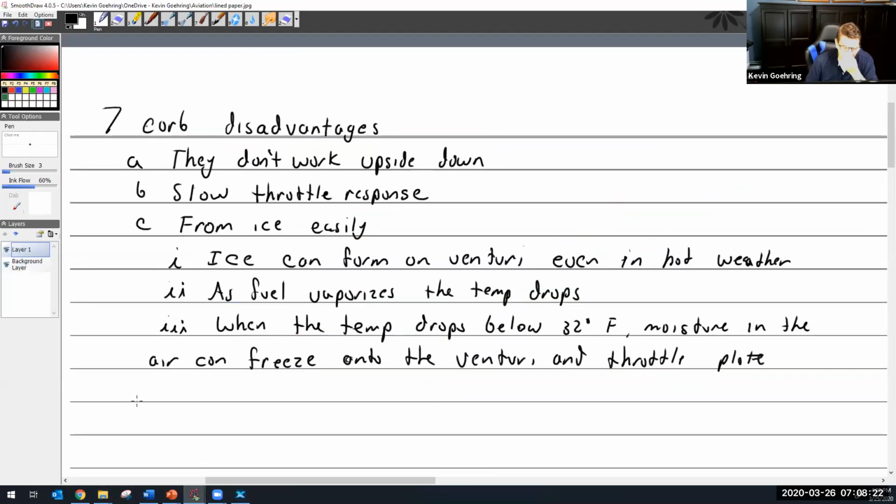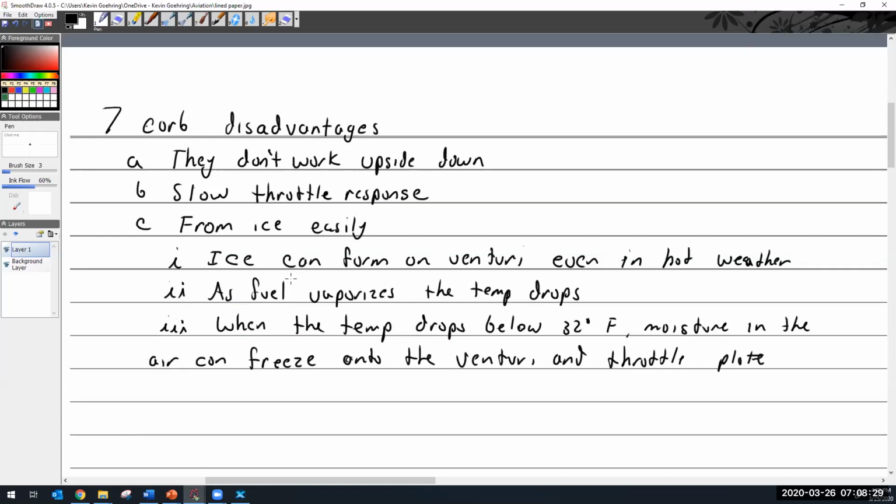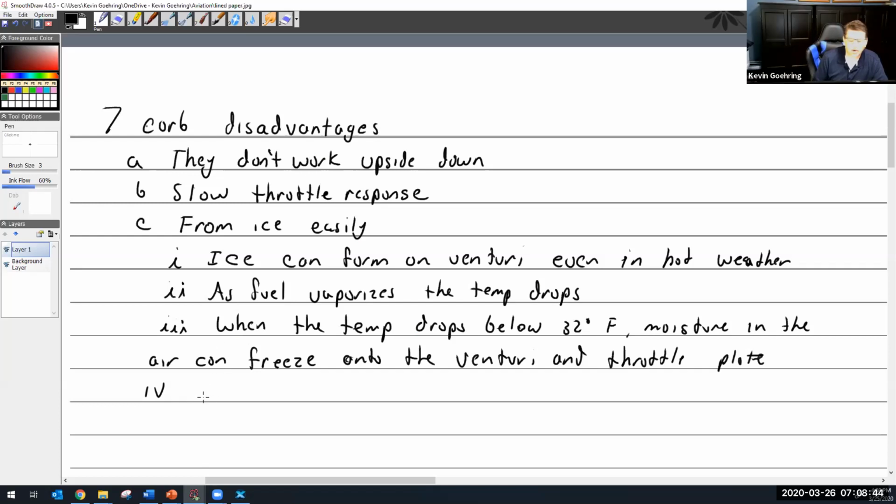All right. So we have carb heat. Kind of a question for you, Kevin. On a lot of the newer aircraft, they have carbon monoxide leak detectors. Are those in the cabin, or are those near the muffler itself, at the beginning of the leak? No, the carbon monoxide detectors, as far as I know, are all located in the cabin, not outside, because there's too much air flowing around, and it would be diluted air and wouldn't pick it up if it was near the engine.